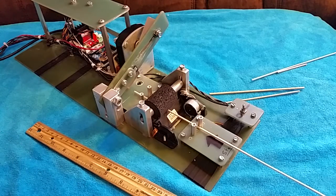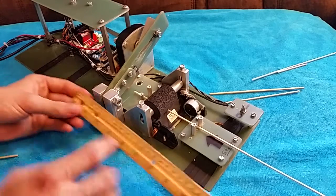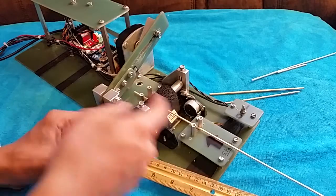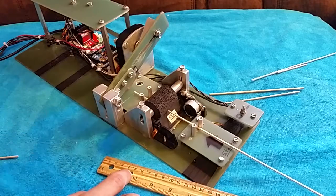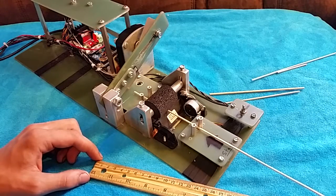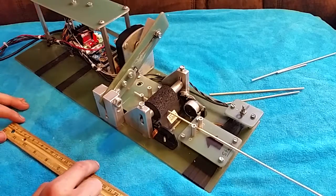I'm not sure if it rounds or leaves off the decimal — you can't really get half a step since it's always between two phases, like 0.83 steps. But I'd rather be a little bit over so all my pieces are a little bit long, because then I can sand them down if I need a specific angle. Half a millimeter isn't a problem. I can input decimal values, but the only thing I can't do is a number less than one centimeter, because when it takes the input of one and multiplies by 153, something in my variable rounds it off.